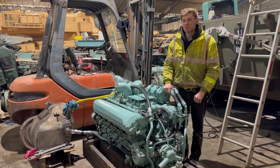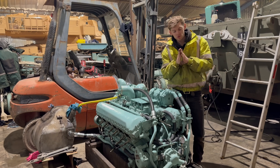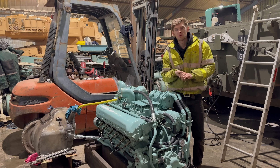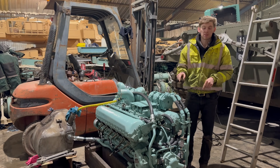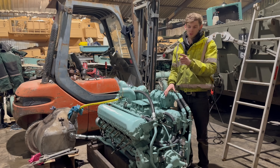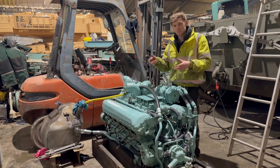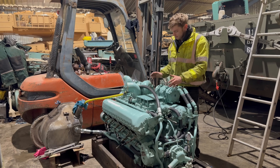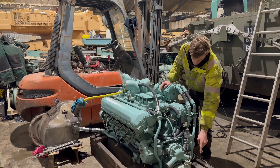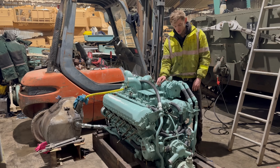So we've seen it run now, finally, and it did run pretty well. The initial trouble we were having was the magnetos not sparking — the points themselves had actually just stuck together over time, and just a tiny bit of corrosion had made the two points stick together. So we scraped them off and they were sparking like a trooper. We normally have to take them off and run them up in a drill, but they were in really good condition. The other issue was fuel pressure — we weren't actually getting enough fuel to the carburettors initially, hence why we used easy starts just to get a bit of a pop and get the engine to spin over and suck a bit more fuel in. The two carburettors are actually Zenith carburettors — full size, massive great things. They do pull quite a lot of fuel. It takes quite a bit of time for the fuel to pull up from the can to the lift pumps and into the carbs, but with a bit of perseverance she started up and ran all right.